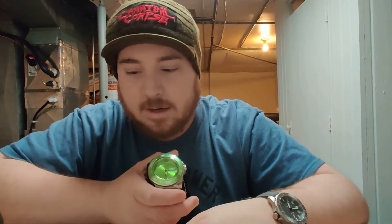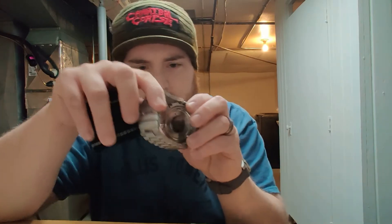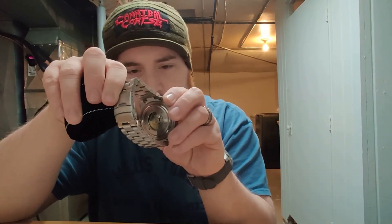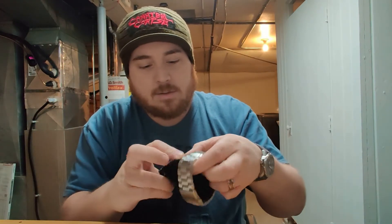The first thing is the color. It's a mechanical movement, so it's automatic. You can see the little rotor back there — we'll get to the up-close shot. It's a Seiko NH36, so it's got the day and the date, which is really nice. It's a hacking movement, which makes things much easier and allows you to be a little more precise, which I really like. It's got about a 40-hour power reserve, which is standard for about any Seiko NH36 movement out there.